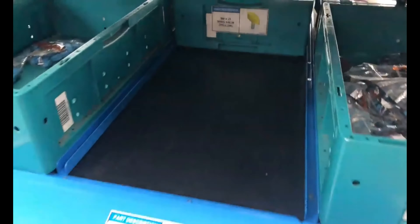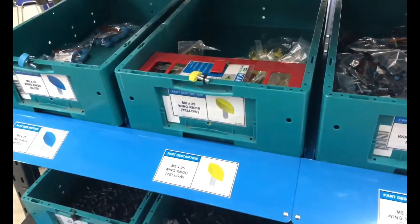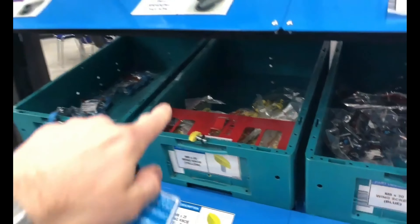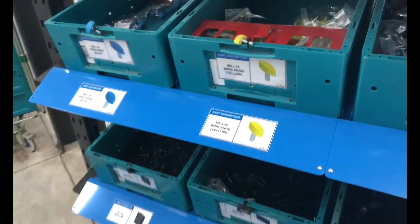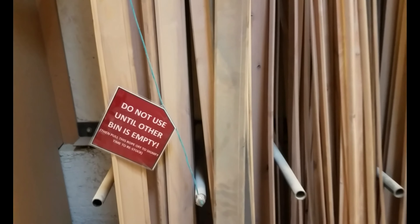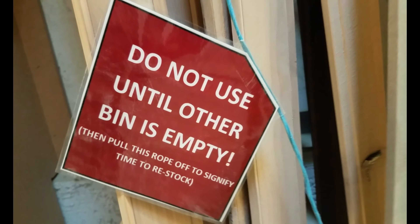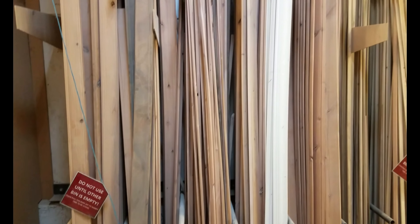The result is a reduction of stock in both bins at the same time, and this leads to the Kanban signal to restock being triggered too late because the minimum level is much lower than it was designed to be. This can then lead to the user waiting on material to arrive before they can continue production. So to help prevent users from taking from the wrong bin, Alan had some visual aids made — signs attached to the crossbar ropes that give clear instructions not to take material from specific bins and what to do when the bin in use runs out of stock.